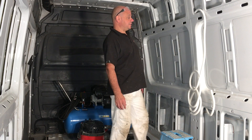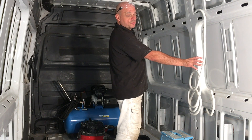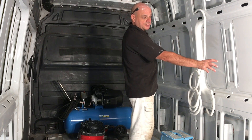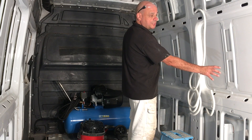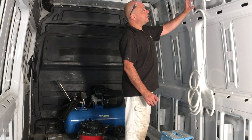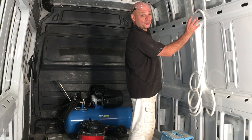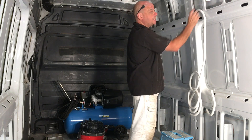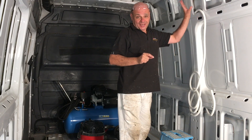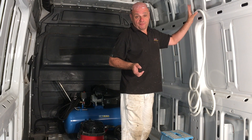There's going to be a kitchen area here. We're going to have some 240 sockets and an inverter socket down there — a permanent dedicated inverter socket. 240 sockets for hook-up, a 240 socket up here for a microwave oven on hook-up, and next to it I'm going to have an inverter socket as well, so at a pinch I can swap the plugs and use a microwave off the battery if I'm off-grid.